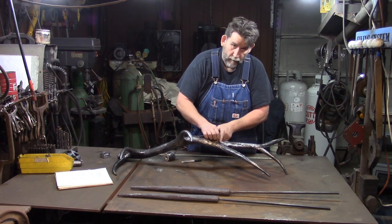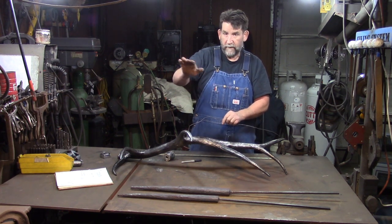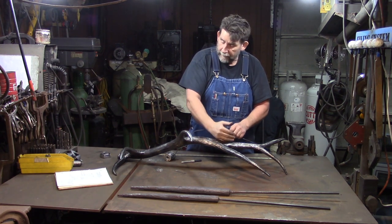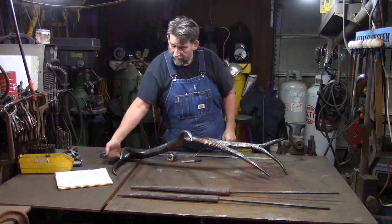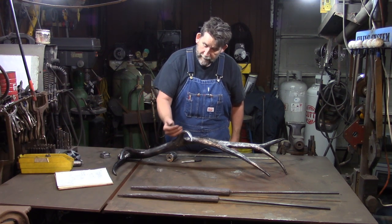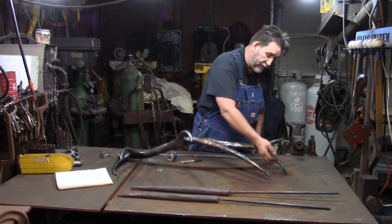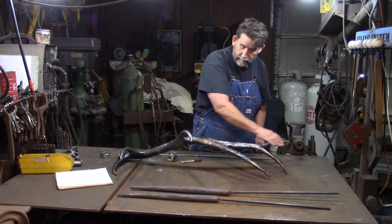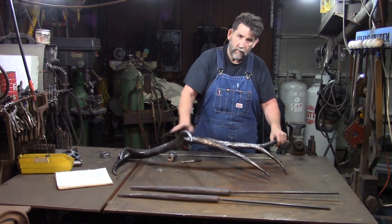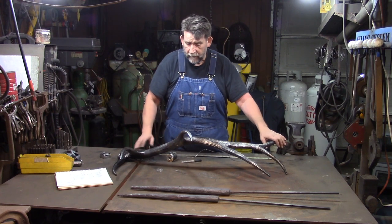Now we mark our steel, we bring this over, we look at where it's positioned on the rack. They're not all in line. This one's down here at about, we'll call that 9. This one's a 10. This one comes up, it's still probably about 10. This is back to 9. This is about 8:30. And then this is the original. So you gotta watch where they're positioned along there. Okay? And you do that on down here and you weld them on.